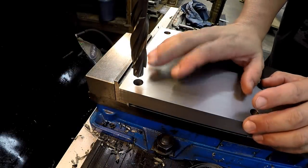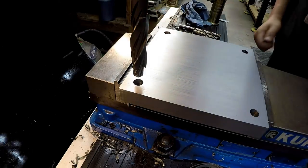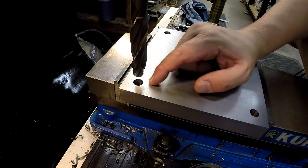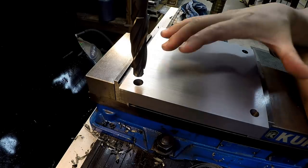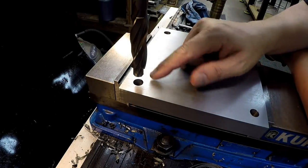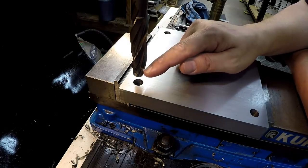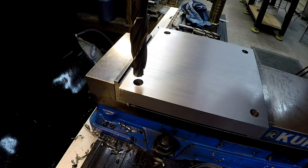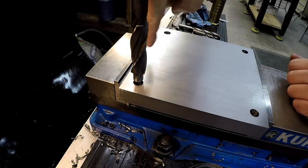Okay, we're going to go ahead and get our counterbores done now. So I've got this mounted in a half inch collet and running nice and true, as you can see right there. So here's the other reason why I don't drill these holes oversized to begin with. If you need to oversize them, do it after you do this procedure right here. These things are designed to pilot on the hole that you drilled. So this area right here that's ground is ground half inch, and that hole is to pilot that and keep that thing from walking off like that.